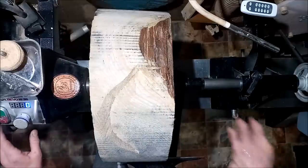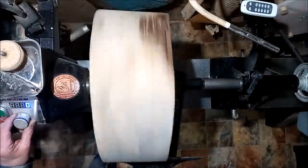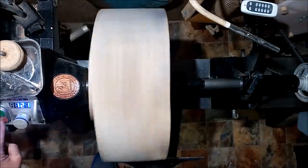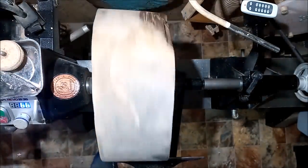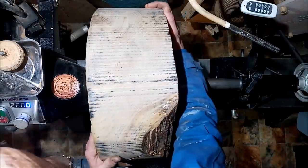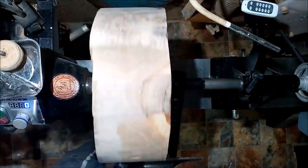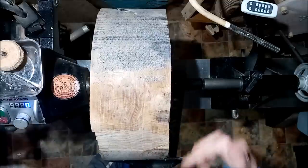The simplest way to explain this is I'm going to show it to you. Right? Start the lathe and bring it up to, say, something low, 120. There you go, 121, right? And I'm just going to stop the lathe the way you normally would if you were turning a normal bowl. See the way it's hitting now. What's happened is this is now loose. Right? See, I can turn it back. The weight of this acted like a flywheel and actually unscrewed it.